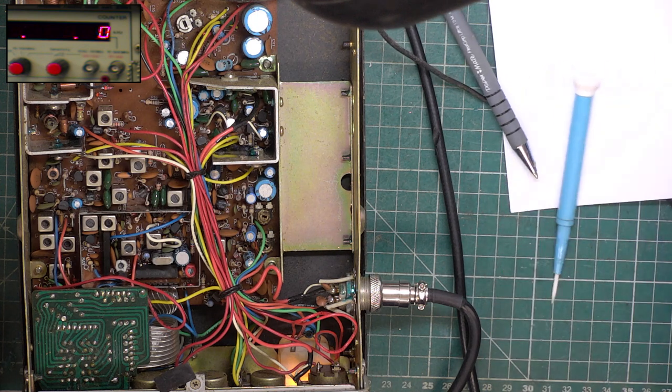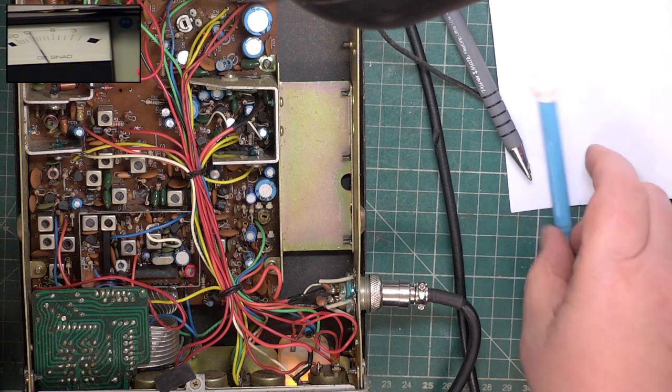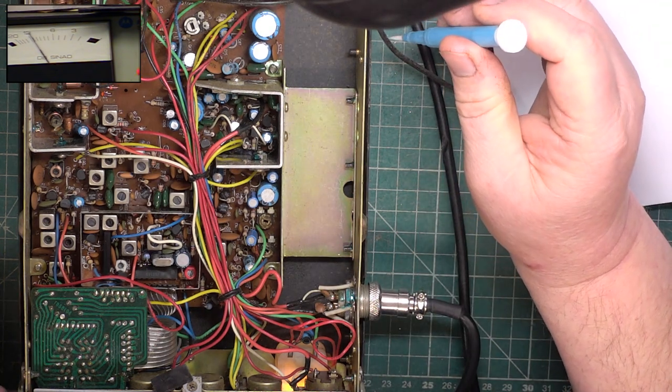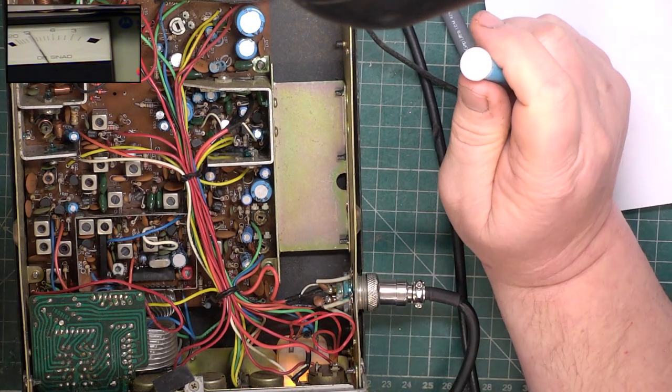So we'll start with the front end. We'll go with the SINAD meter. Camera's moved. So as ever, we're going to want... Oh, I need to set this back on frequency because I knocked it off frequency, remember, because the radio was off frequency. So we had a fair reading. If I can bring this sensitivity up, this could be a really, really good set. We could get rid of the Midland in the car and have a GT868, couldn't we, in the test car?